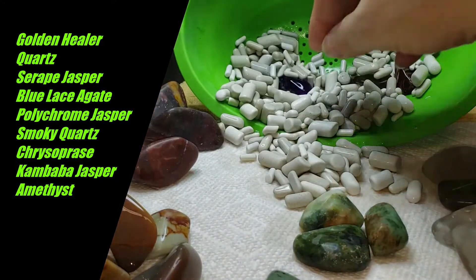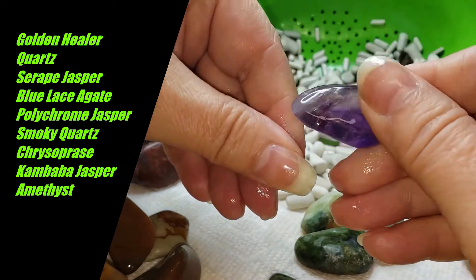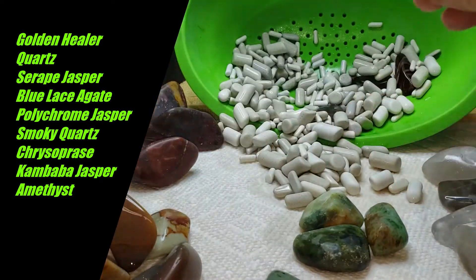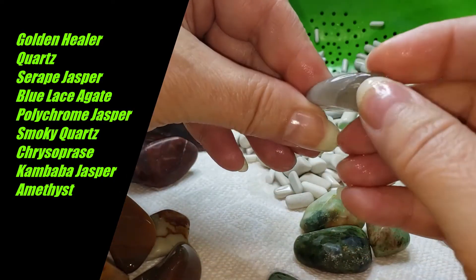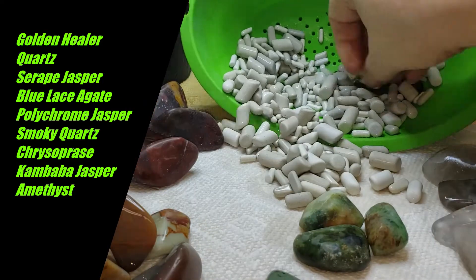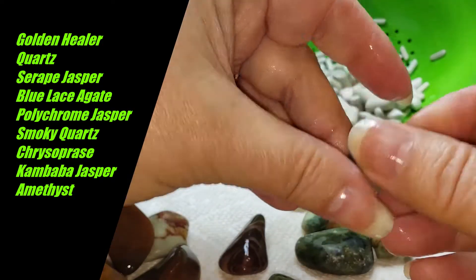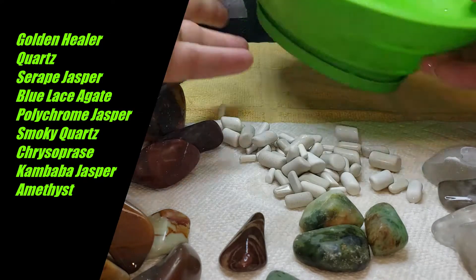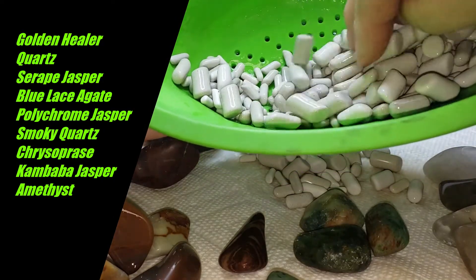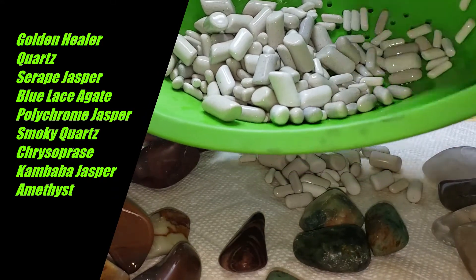I think we're definitely splitting this out — we're taking out the damaged pieces. If we have a tiny barrel available, because this isn't a three pound and there's not enough to go back in the three pound, I think we're going to split all this out. Most of this can go forward to 1,000 grit. I'm not seeing any more chips, which is bothering me because there was so much damage — I'm wondering where those damaged pieces went.